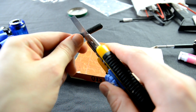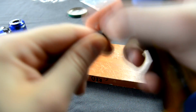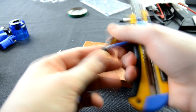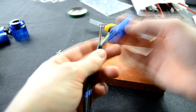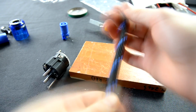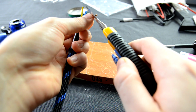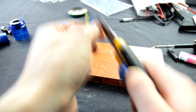Now gently remove the outer isolation sleeve from the power cable, without cutting the inside wire core's isolation. When you're done, put the Neutrik PowerCon jack part on the cable, because after you put the screws on, you will not be able to put the PowerCon on it. Now remove the sleeve from these 3 wires, so we could use the soldering iron and set up the jack.